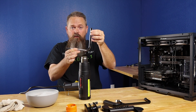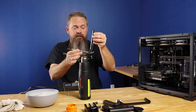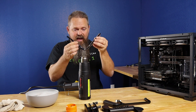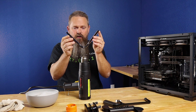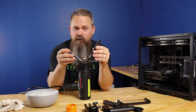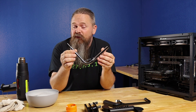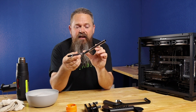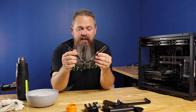Don't drop the tube back into the water at this point because we're using acrylic tubing, and acrylic can actually crack if it contacts water while it's too hot. It is okay to blow on it. Just hold it in the shape you want for a period of time so it can cool down. It is really hot to the touch, so be careful — heat guns can hurt you. If you think you need to, wear gloves while doing this. Heat guns get extremely hot, and the acrylic has to be hot to bend. Now we have a really clean 90 degree bend.